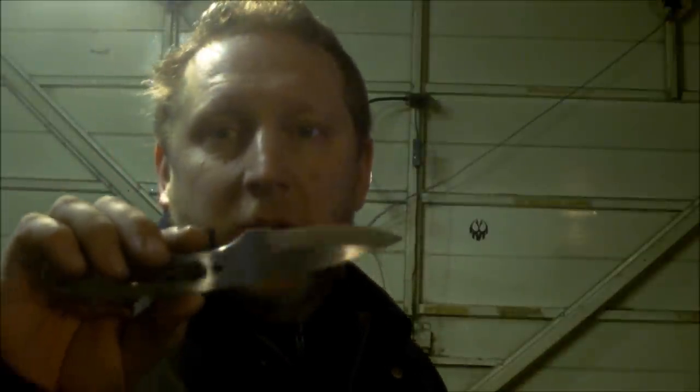So that is the stage it's at at the moment — coarse grit, got it as flat as possible. I'm not too worried about the finish at that point, because when I put the bevel on I've got it flat so it sits in the jig straight. I set the bevel so I get the same angle on both sides and get an edge on it. I'm not too worried if there's a slight burr — I know it got to an edge. What I'm interested in now is getting the sides finished so I can put my logo on.